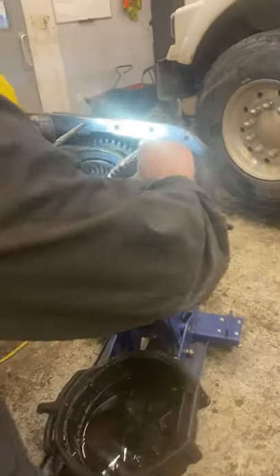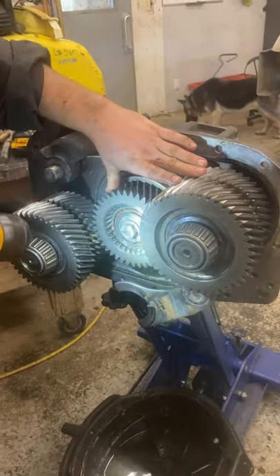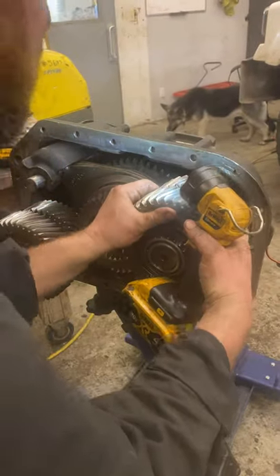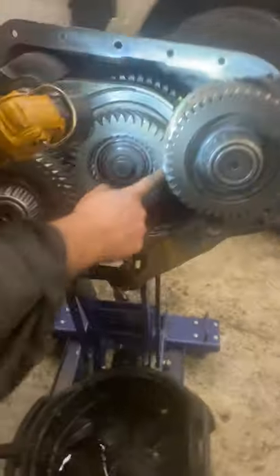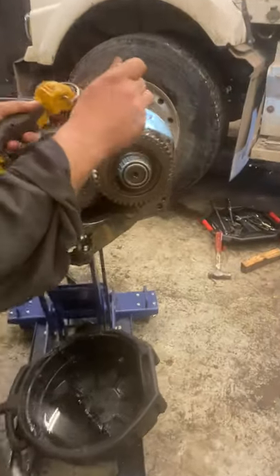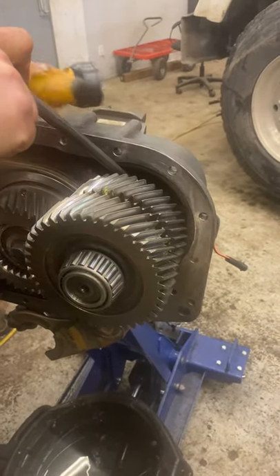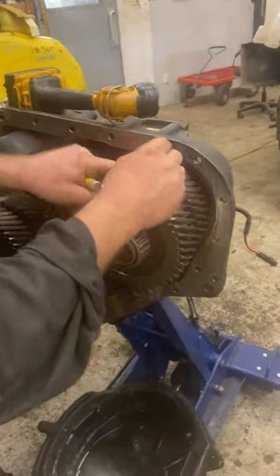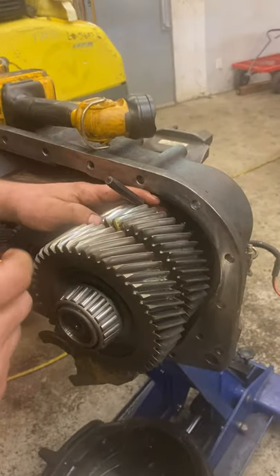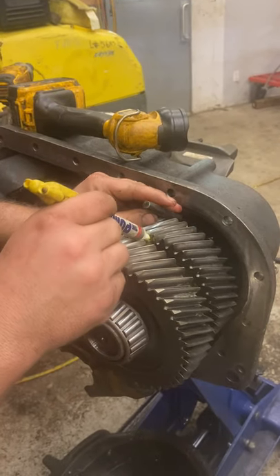When you do that, that meshes the first gear. But you can have this gear meshed and in time while these outer gears actually aren't meshed in time. We had it so that once those two are meshed, this shaft can still be a gear low — like this can be down too far and still wedge. So when you do that, you take something straight and line it up on that groove you just made. Use a straight edge — you line the center punch up in that groove, and then this lines up with this groove.